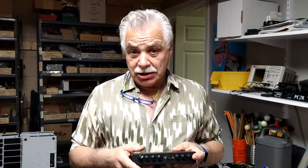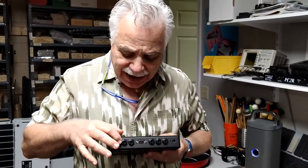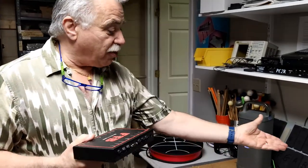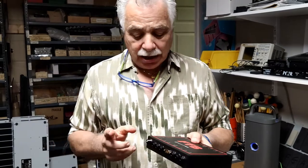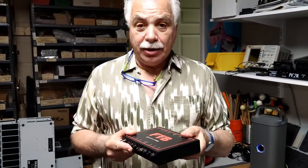You just plug it in and it becomes single zone or dual zone. On the back you have the same thing — six outputs that are either single zone or dual zone depending on what you plugged in on the front. When you plug something in, luckily with our KTM-1 module or two-box module that has stereo inputs, you just take a stereo cable in to a stereo cable out and away you go.